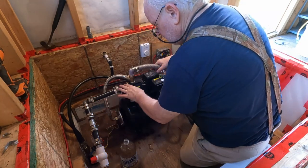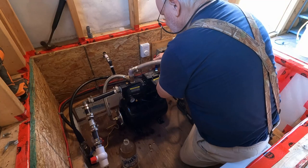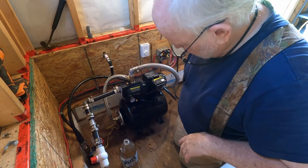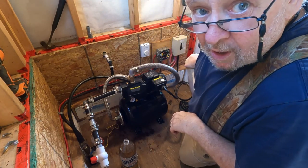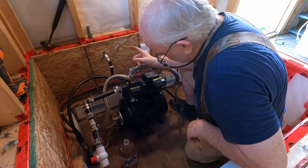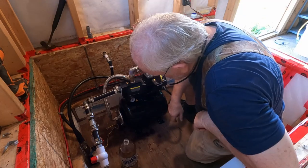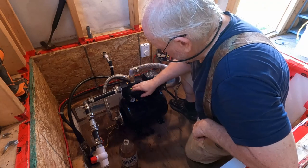So what I'm going to do is hopefully draw water out of the crocks into the pump body, out through here, down this braided hose into the pressure tank — but out through this line I had this valve shut off, so that shouldn't go anywhere because I just want to charge the tank right now and see if it builds up pressure. So here we go — the first start of the pump, see what happens. Well it sounds like it picked up the prime right away. How about that — it picked the prime up right away, I'm impressed with that. Anyway let's see what happens when I open this. So I'm flowing water out the wall hydrant and it's also purging air. Pump pressure is dropping — I don't know how well you can see that gauge. And even with water flowing it'll build pressure and shut off, so the pump is doing pretty good.